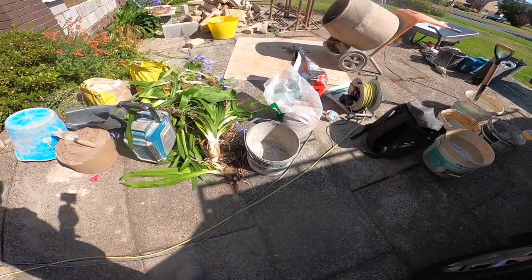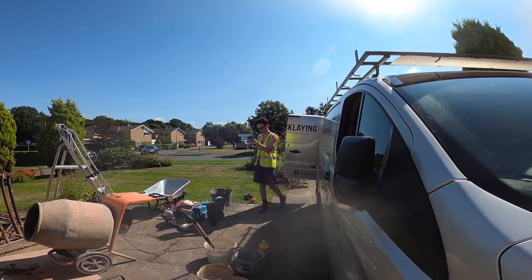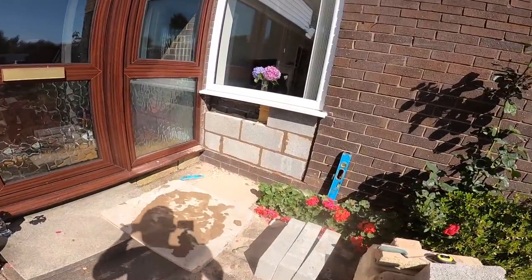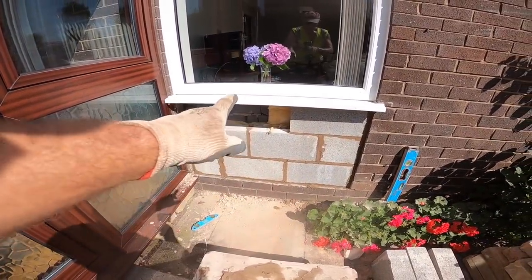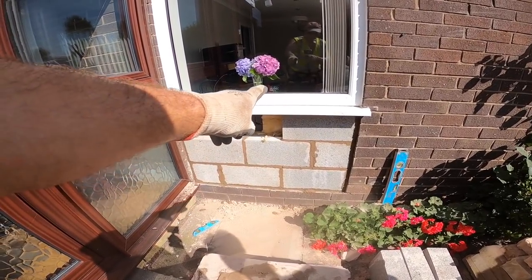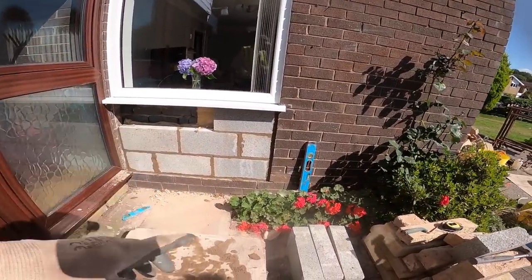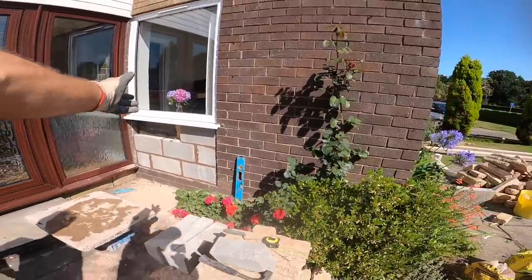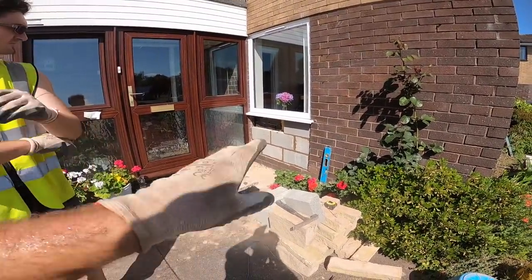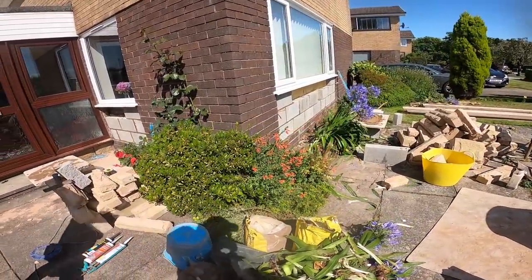We're on about 1 o'clock now. Okay, that's not bad. Alex's side's done, bar 1.5 blocks. You can see the ties in the walls. The reason it's not been finished is, plenty of blocks, we've just run out of insulation. I've only brought enough for doing the lintels and forgot about doing the windows, so we're a quarter of a slab short. Yeah, I know some people just say, oh, brick it up, but no, we'll wait till tomorrow and bring it with us. We're coming back tomorrow, so there's no rush, is there? No.